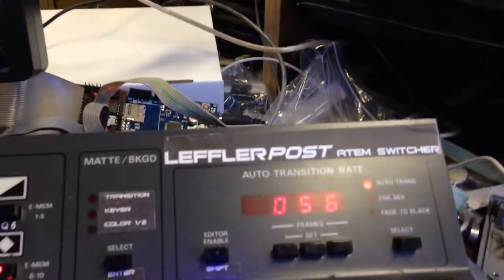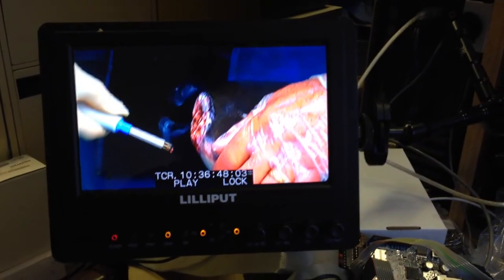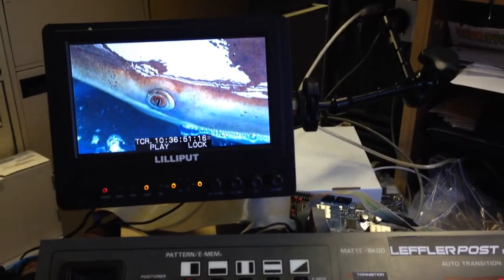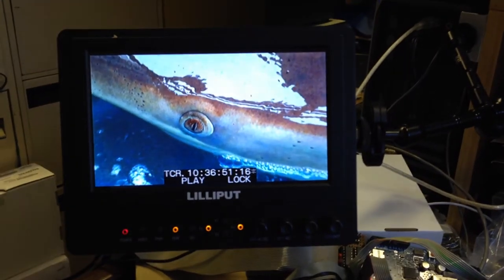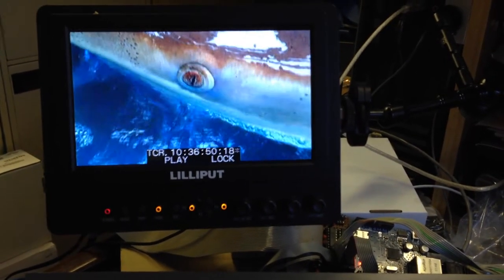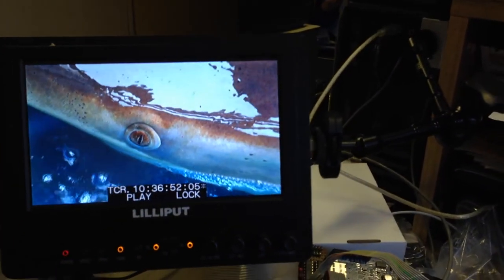While in slow-mo you can wind the speed down and back up again. To go to freeze frame, pull the joystick down to zero, then hit the jog button, and take your finger off the joystick — it's now in freeze and shuttle mode. From there, if you want to track slightly backward or forward — even while on air — you can use the joystick. For sports coverage where you want to go back then restart slow-mo, you can go back into vary play and repeat the process.